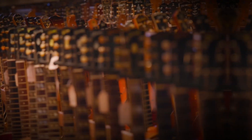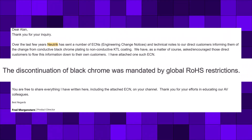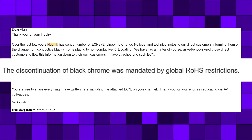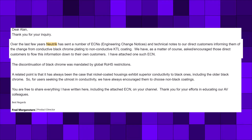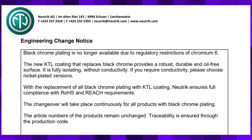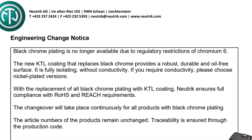Unfortunately, the cables with the black connectors seem to be popular for vendors to stock and consumers to buy. Until recently, Neutrik used a conductive black coating for their black EtherCon shells, but that has now changed to non-conductive. I spoke to Neutrik about this change and was told the discontinuation of the black chrome was mandated by global RoHS restrictions. They sent engineering change notices to their direct customers, but I suspect a disconnect occurred in getting this info out to consumers, with many music store sales staff simply not understanding this or realizing its importance in the X32/M32/Wing ecosystem.